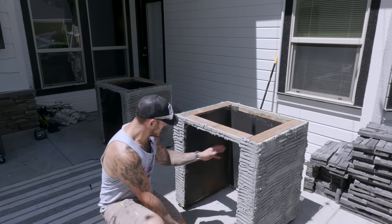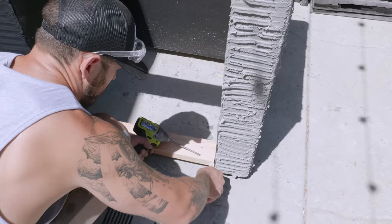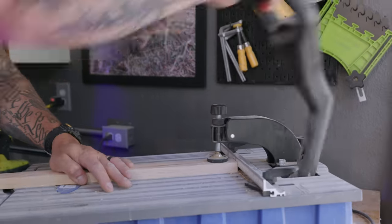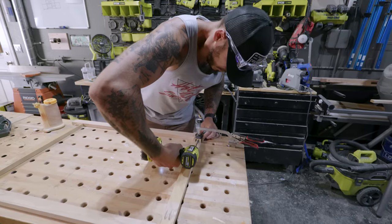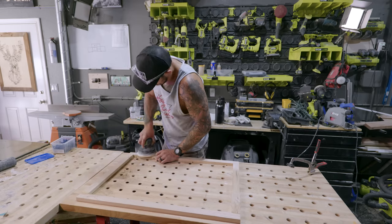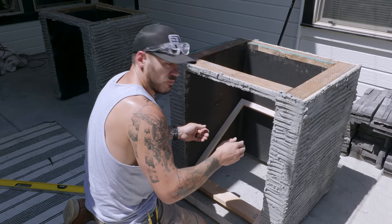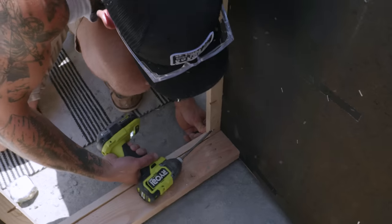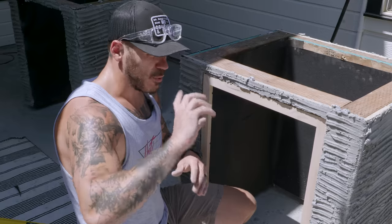Since this is going to be where the sink will be, I'm going to build a face frame. I'm going to put this piece in place, connecting this together, and build an inch-and-a-half face frame completely around using pocket holes. I'm going with oak because it's easy to get. I'll attach them together with pocket holes, then put pocket holes on the insides so I can secure it through the side. When I'm done building the door, I'll take the face frame and doors off and marine varnish them.